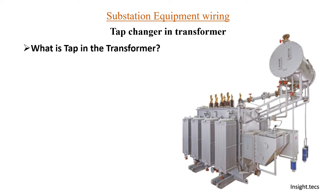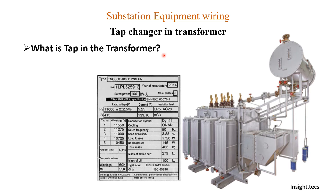What is a tap in the transformer? Having understood the grid code and the importance of maintaining rated voltage, the answer to achieving that rated voltage is the tapping in the transformer. On the nameplate of a transformer, taps are numbered 1 through 5. The HV side is rated 11 kV and the LV side is 415 volts. On the HV side it is mentioned as 11 kV plus or minus 2 × 2.5%, indicating tappings are on the HV side, while the LV output will remain constant at 415 volts.